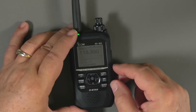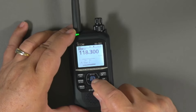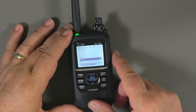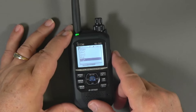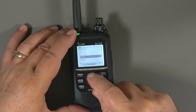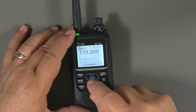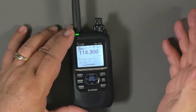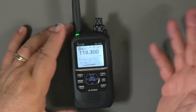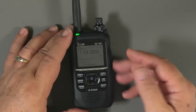A long press on the low button on the rocker panel gives a power dialog. The radio has high, mid, low, low 1, and super low settings. Super low is what I normally use — it transmits at about one tenth of a watt, which is especially useful in D-STAR mode when I'm transmitting to my Pi-Star hotspot right next to me.